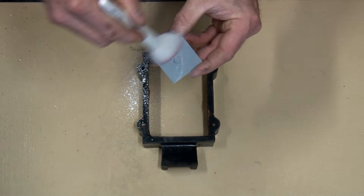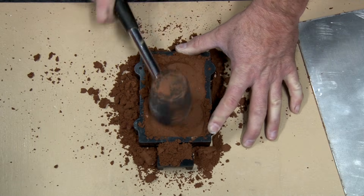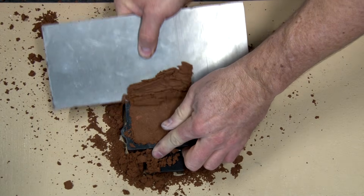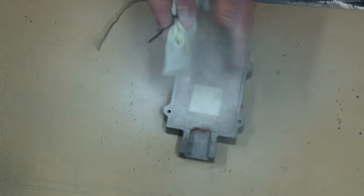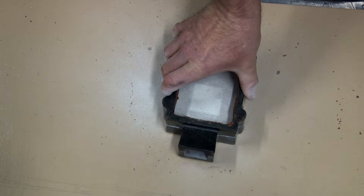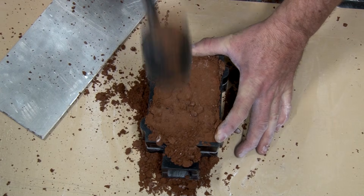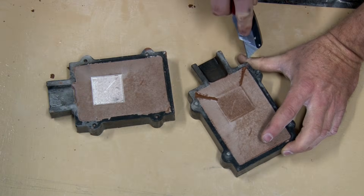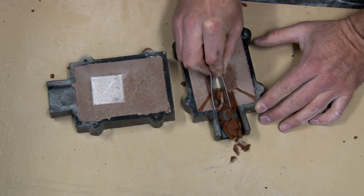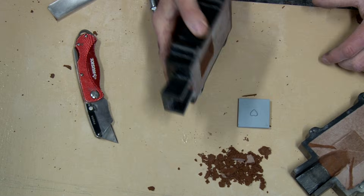This one's the Outie — just like people's belly buttons, this one points out — and there's another heart that goes in, so we'll see the difference between them. This process is sped up quite a bit for packing up the mold; I have plenty of other videos that go into in-depth mold packing. I'll also find out in this video that I didn't put a taper on my pattern, so it's going to tear out the sand a little bit, but that's okay — I'll just use a sander to clean it up.